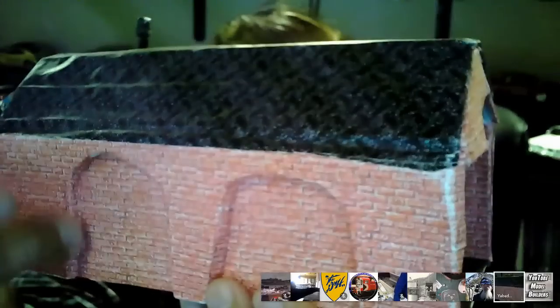It can only go as fast as the maximum amount of power that's there. Well, it should theoretically drop no matter what speed you are, because the speed step, or the CV, is telling it how much of the voltage basically to use. It's using half of the wave. If the wave is only 7 volts, it'll give it 3.5 volts. Well, I agree, there is some effect, but a speed step setting is how many volts, not what percentage of your voltage. Well, there's 255. The value of, say, CV2 is anything from 0 to 255, with 255 being 100% of voltage, and it's set on a base where 127 is half of the voltage and 0 is none of the voltage.